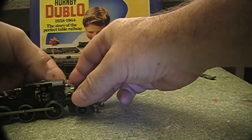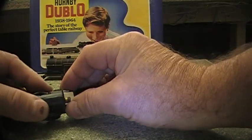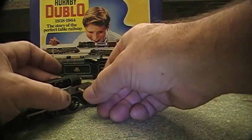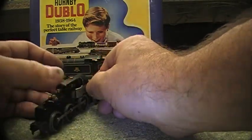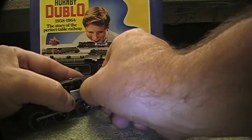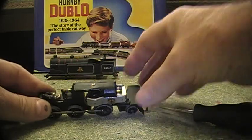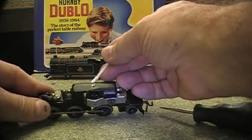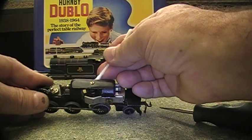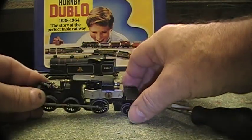I hope I got this the right way round. If it's the wrong way round it will travel in reverse, so if it goes in reverse then you'll have to turn the magnet around the other way. You could of course use a compass to find out which way round the magnet was originally and then put this one in accordingly. Let's just check that it's not catching on anywhere — sometimes these magnets are not exactly the right size. Also, you should always make sure the faces are perfectly clean so that they mate up properly.